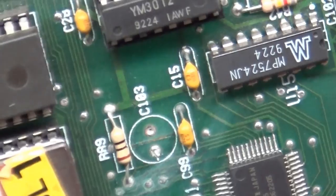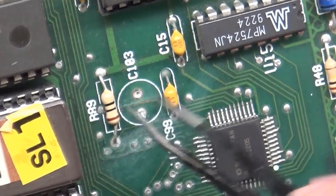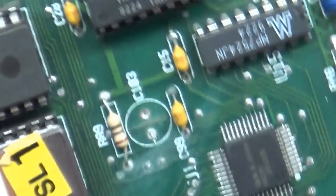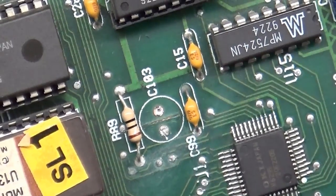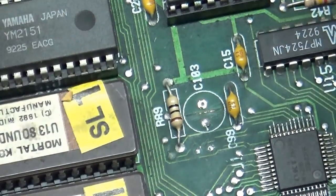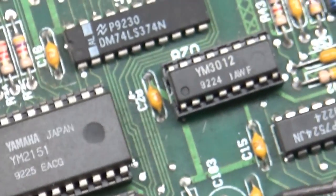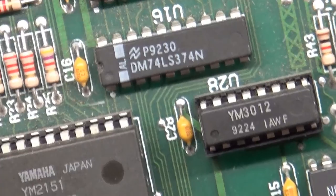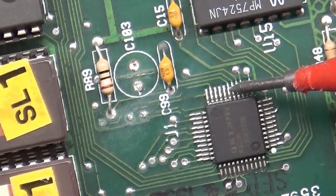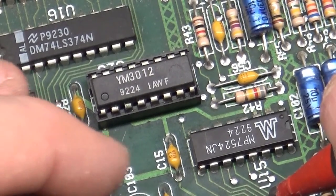I think our only issue is this guy right here. I think this is just completely eroded away. There's nothing under there. I think that's PCB. This isn't copper. That's part of the board. Yeah, that goes straight to that via. I'm just surprised I can't pick up anything off of it. But it runs over to... runs over to here. So if we were to go there to, yeah, see, this whole run here is open.